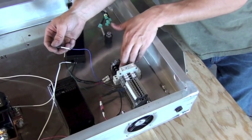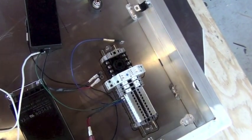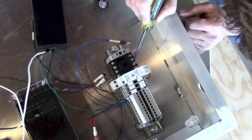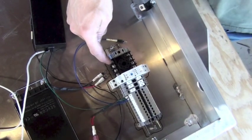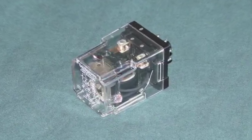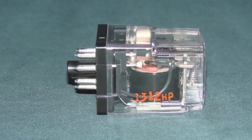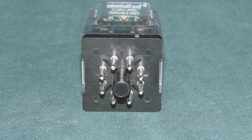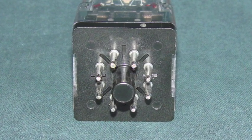Position 6 is one of 8 different positions on our charger relay connections, visible in the black part of the DIN rail. The charger relay plugs into the center circular part of this section of the DIN rail and performs different functions. One function is to prevent the vehicle from being operated while the charger is plugged in — so you can't drive away with the charge cord attached. Looking closely at the relay, you can see the circular pattern of plugs numbered 1 through 8.